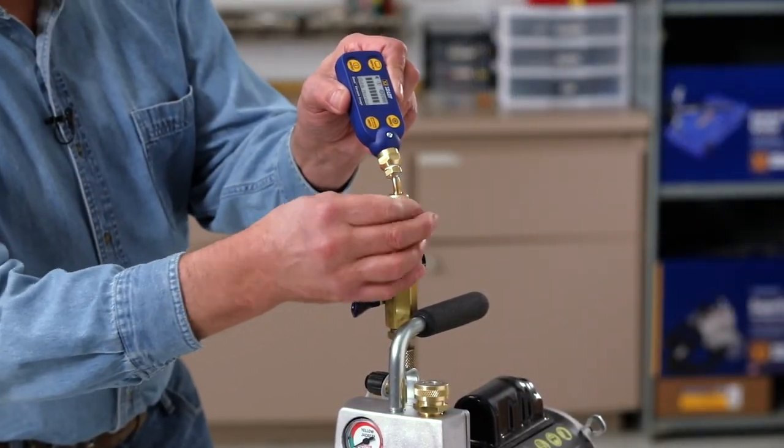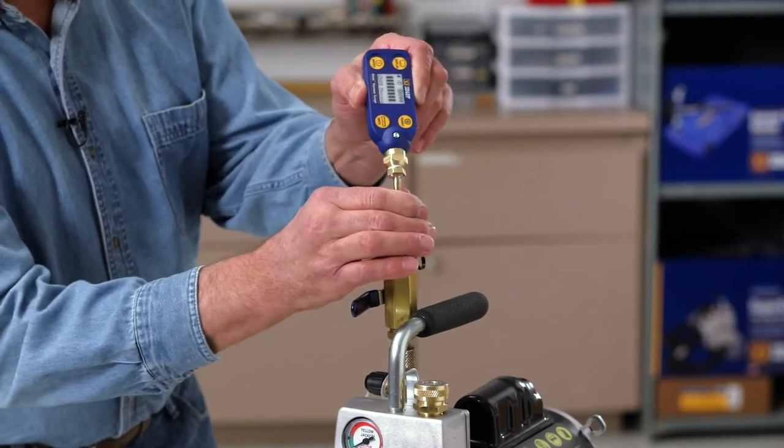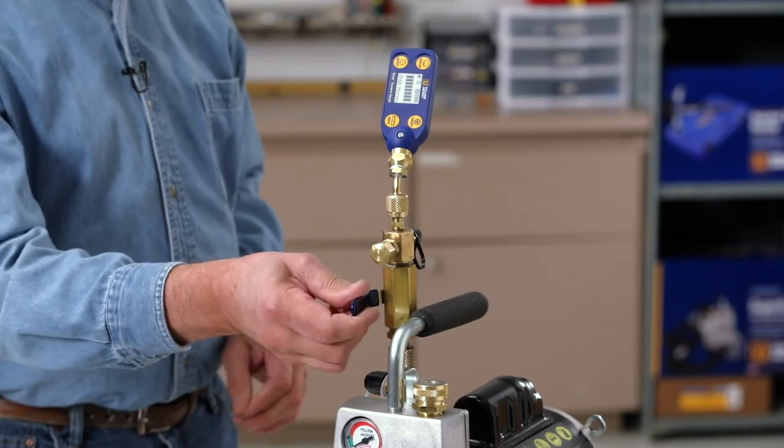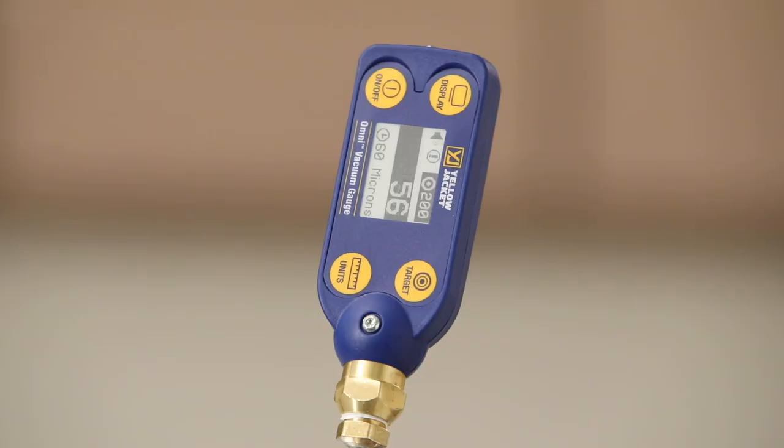Place the gauge on the vacuum pump to evacuate the residual solvent. Leave the gauge on the running pump until it's reading accurately. If the readings are not within the desired accuracy after 90 minutes, repeat this cleaning process until the desired accuracy is obtained.